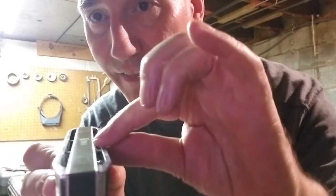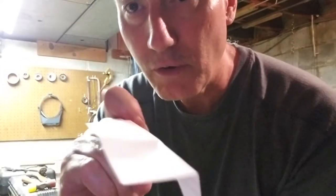Let me go over a few things. See how the cover comes this way and then like that? That's a 90-degree crimp. What I want to do is make this cover open up gradually. But if you take a 90-degree turn of metal and try to bend it, it crimps and it would be ruined. The only way I can put an arc into this cover is to first take this back edge and pound it with a metal hammer, giving it an angle of about 50 degrees, and then I'll be able to reshape.